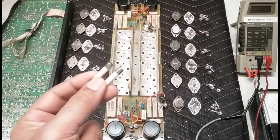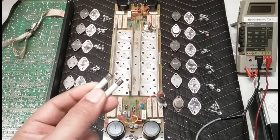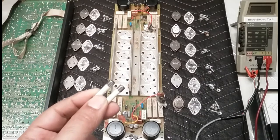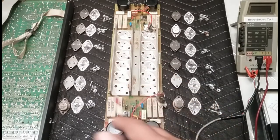I located these two open — or shall I say blown — 10-amp fuses that certainly performed their duty well. They responded to an obvious fault situation, so they did their job. There's a total of four fuses, two per amp section, that interconnect the secondaries of two power transformers to this 304S output board.